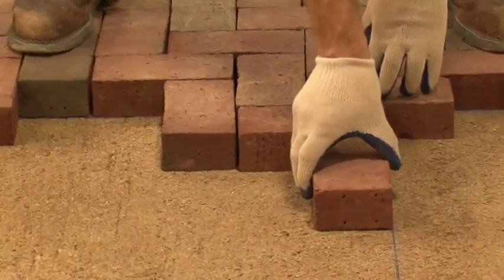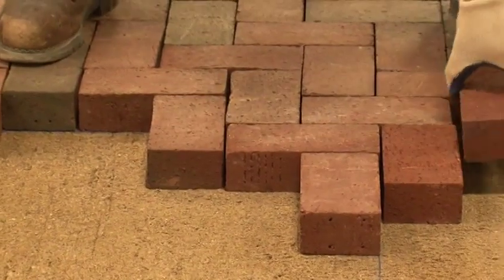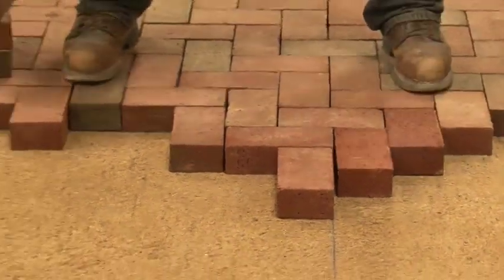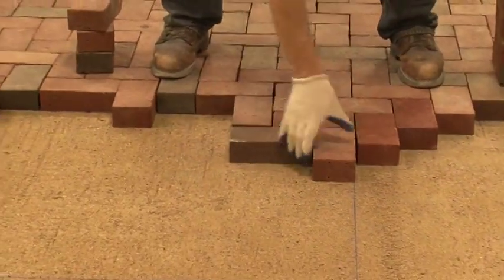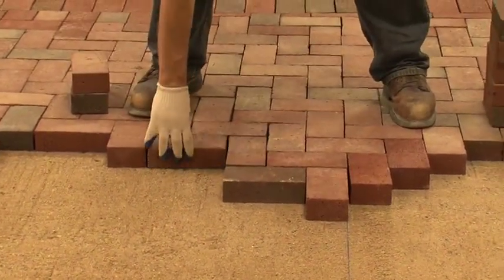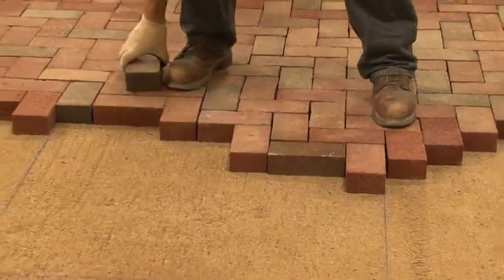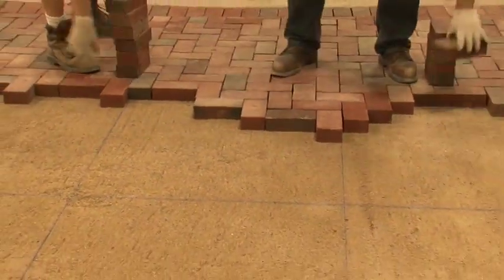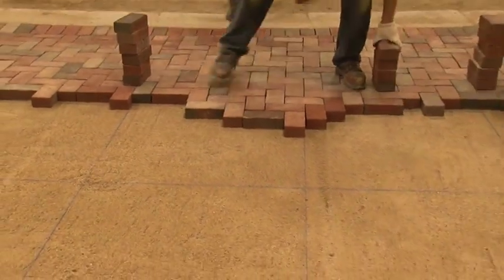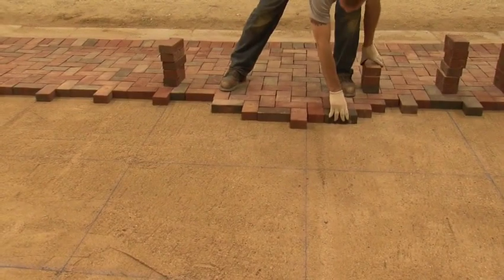When your thumb is to the inside, your fingers, arm, and wrist are more capable of holding the paver into the pattern. When you're ready to set the paver, slowly release pressure from your fingers and the paver will slide into place. Doing this correctly eliminates displacement of the sand and reduces wide joints. If you were to turn your fingers in, not only do you have a better chance of hurting them, but your thumb cannot support the paver and it will drop unevenly into the sand causing disruption, wider joints, and more passes with the compactor.